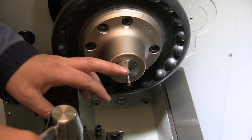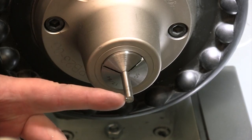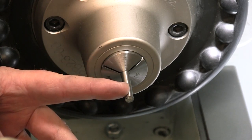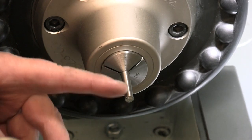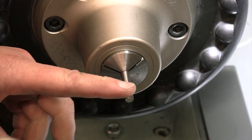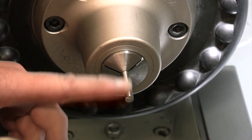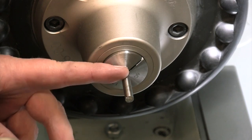All right, I'm pretty sure if I leave 1 1/4 inch sticking out on here, then I'm gonna be able to finish all three of those without having to move that out of the collet, and I'll just drill in a little bit each time, part it off, drill in, part it off, but I'll turn the outside. We're only taking a 1/64 off. This is 17/64 titanium, so just a 1/64 over a 1/4 inch. So I'm gonna take about 12 thou off the outside.